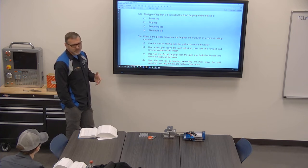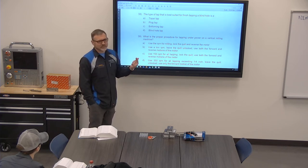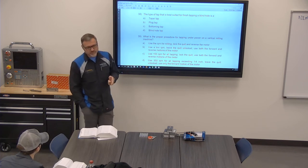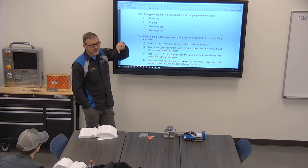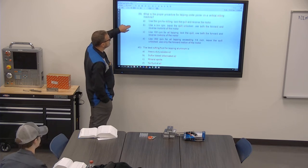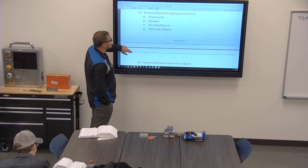Honestly, when you're trying to machine tap, you're looking for fewer flutes, not more flutes. A bottoming tap allows you to have threads all but like the last thread and a half at the bottom. So pretty good. One of the other things we've switched to is a lot of spiral flute taps, so that they're pulling the chip back up, even if they're just a normal through hole, rather than pushing the chip down. That way we can take care of getting those chips out of there. But we have to make some decisions about what taps to use and what's the best thing to use.